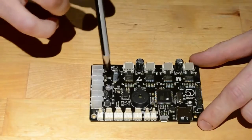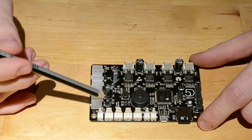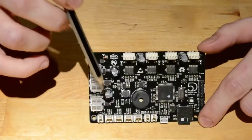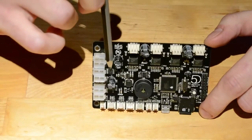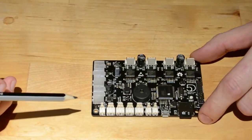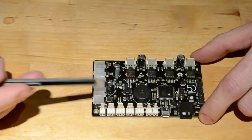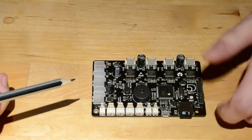You'll also notice that we've got rid of the through-hole TO220 FETs that were previously driving the heaters. We're now using these surface-mount NXP devices here — generally a much more efficient package thermally, and they heat-sink directly to the board rather than waving around in the air or needing a big screw-on heat sink as with the TO220 packages.